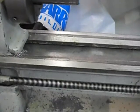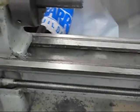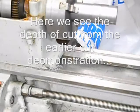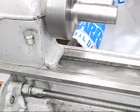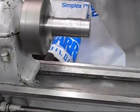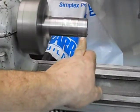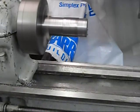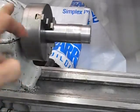There are very few nicks to the ways. There are three prismatic ways on this lathe and one flat way — the flat way is on the inside of the front. The spindle runout looks very good. I'll just spin this again so you can see how accurate that chuck is. We turned this part on another lathe, and there's very little runout in the workpiece, so the chuck is actually quite accurate.